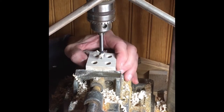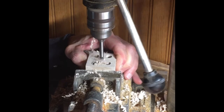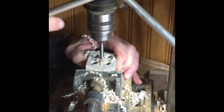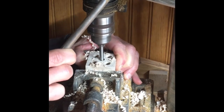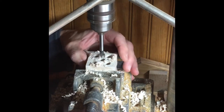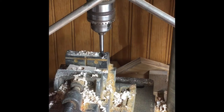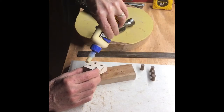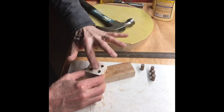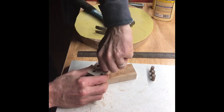To make the walnut circles, I used a drill press to drill the holes. The location was carefully measured and marked prior to drilling. Drilling the holes is pretty straightforward. Then placement of the walnut dowels was also fairly simple — I just put a small dab of glue in each hole and drove the dowel home.